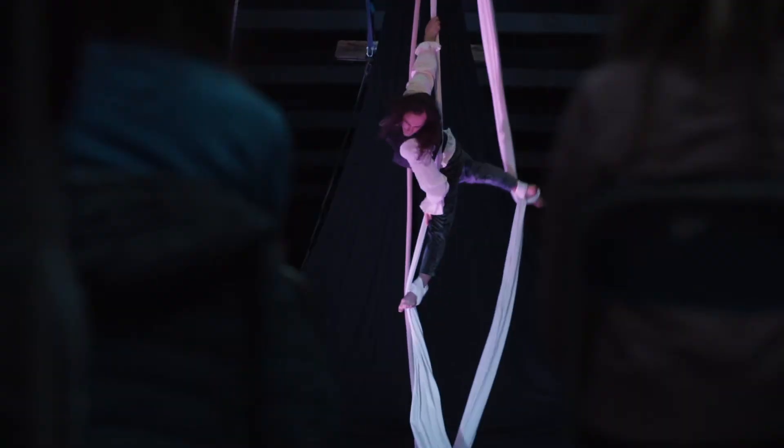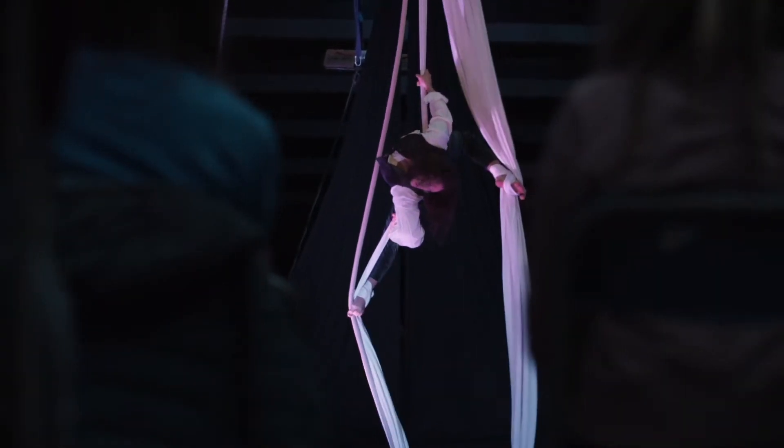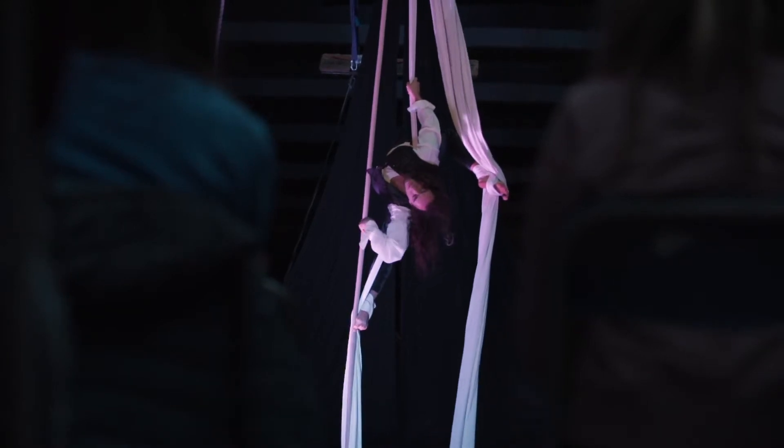As we're looking at home-based solutions, we're only going to look at solutions where we're suspending the equipment from a fixed point. We're not going to include more complex rigging like pulley systems. So how strong does your rigging point need to be? This is probably stronger than you think when you eyeball it. Aerial arts can generate much greater forces than you might imagine, even with relatively gentle movements. It's not like screwing a pull-up bar into a doorframe.